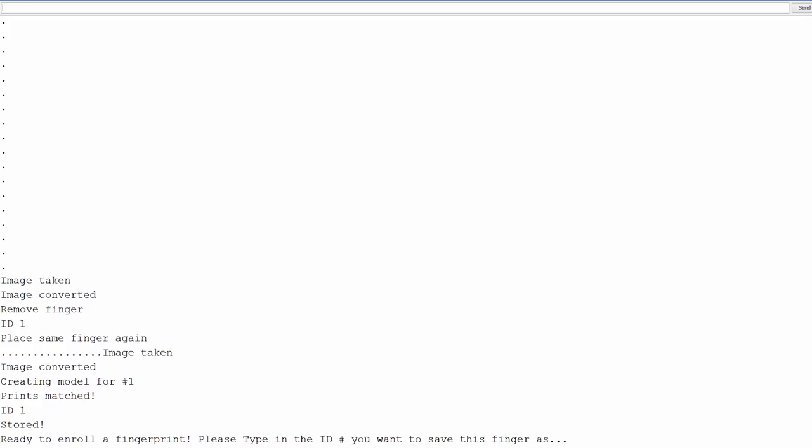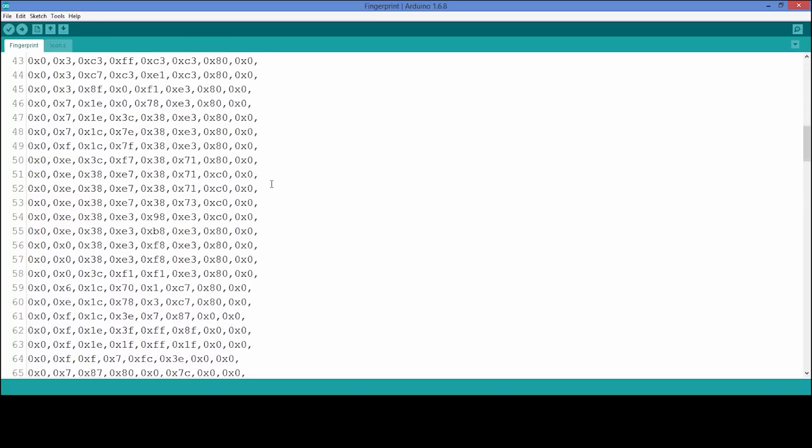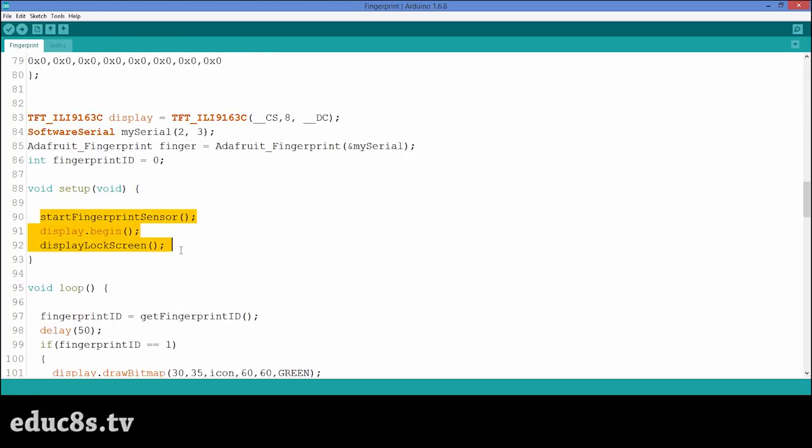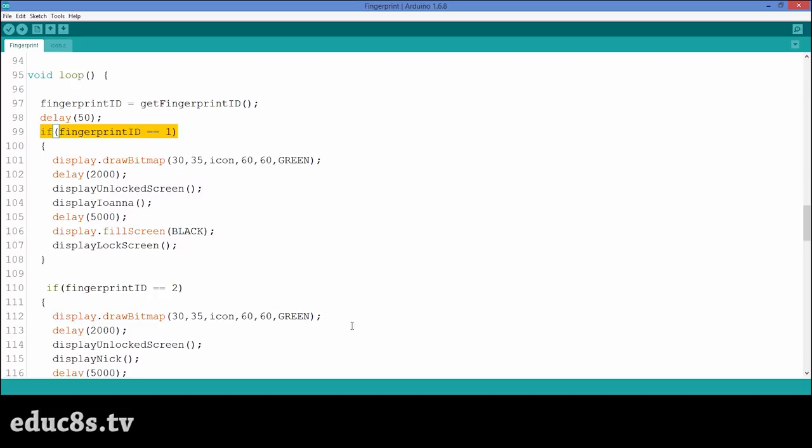Now let's load the code that I have developed. Thanks to Adafruit's libraries, the code of the project is very simple. We start the sensor and the display, and we check for a finger on the sensor every 50 milliseconds. If there is a finger on the sensor, we request the module to search if that finger is enrolled in its memory. If it finds the fingerprint in the memory, it returns that fingerprint's ID. Next, it displays a welcome message and locks the screen again after a few seconds. As always, you can find the code of the project in a link in the description of the video.